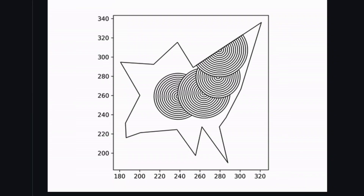The idea is basically very simple. Instead of trying to make long spaghetti extrusions when you're printing bridges, it just creates sets of overlapping arcs, and as these arcs are overlapping and supporting themselves, it basically allows you to print without supports.